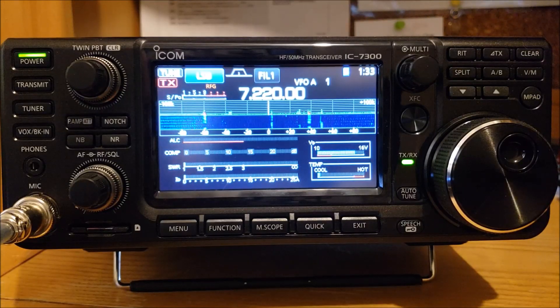The reason I'm doing this video today is because the FT-2DR just released a firmware update, version 1.5, which as I spoke about before in previous videos, it's going to allow the radio to be the node all on its own. One cool feature is you can plug it into a hotspot, and not only does it become the node, but you can actually use the FT-2 to get into the system without requiring a second radio.